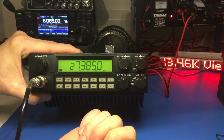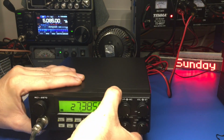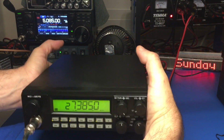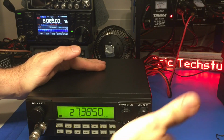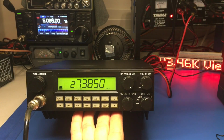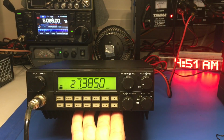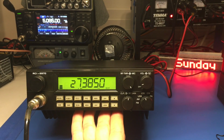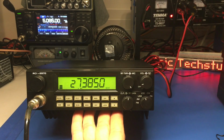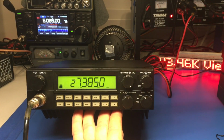But yeah, the first generation here is basically slapped an amp on to a 2950, and you ended up with this. It ends up being extremely heavy due to that heat sink. And inside here, of course, are two... same amp board that it originally had, and it had Toshiba 2290s in it, and it still does. Sorry, I don't know why I'm in past tense with that. So yeah, two Toshiba 2290s are in here.